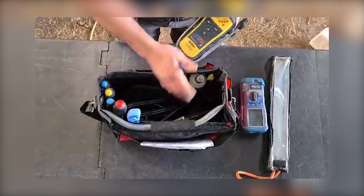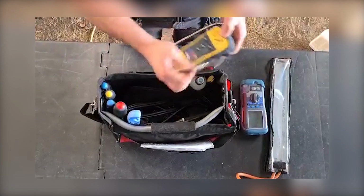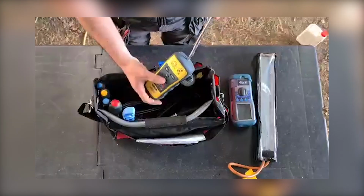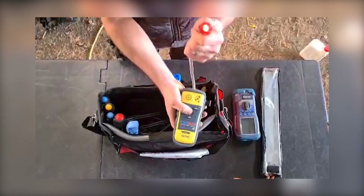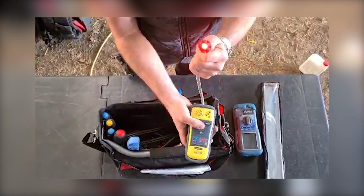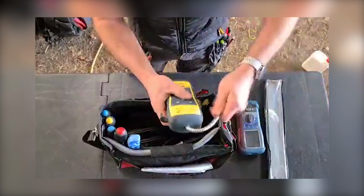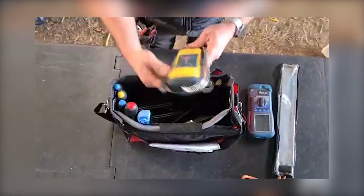Anton gas sniffer, again with it being the gas bag, if we have any job where the customer says they can smell gas. We do have leak detector, but we find it's a lot quicker with this. Whipping it out, as soon as you find the gas leak, you'll see a little red light on there when this picks up and detects gas. It needs calibrating every year. Gas picks up, gas off. A lot more sensitive than just looking for bubbles. You can walk on site with that, put it on the floorboards, little hatches, and away we go.